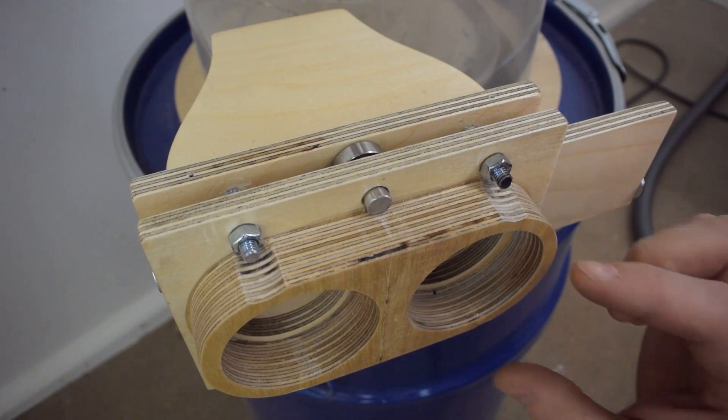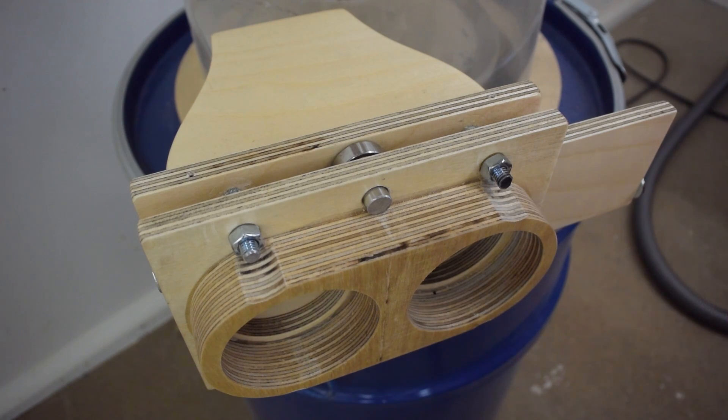What I certainly can do is widen the cross section of these openings, because that would certainly result in a lot more force pushing the plates together. But it would also mean a drop in airspeed, and that will cause material buildup in the blast gate which is really bad, and it would also cause some more resistance. It was an idea and it might just work really well for a bigger system.